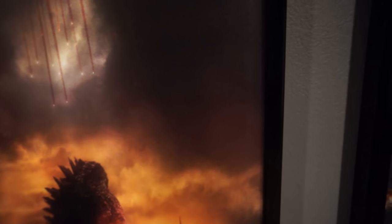So you can buy the whole snap frame from Amazon, which comes with the plastic cover, and also a white diffuser on the back, so when you put your LED in you won't be able to actually see the LED strips, you just see a bright white light. It blocked quite a bit of the light, so I had to add quite a bit of extra light in there to get a decent amount of light coming through. But it's good to have the diffuser.